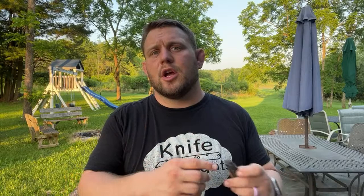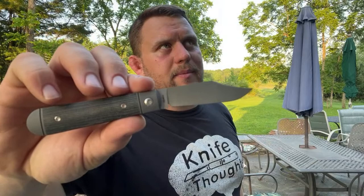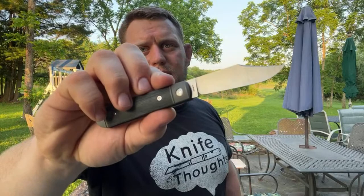I don't know exactly what the current plan is. He told me several different ideas. You can definitely get rid of blade wrap by sharpening — it's just a question of how much edge you have to take off. I measured mine before and after sharpening and took off about half a millimeter. It didn't change the profile a whole lot — it still has that super cool swoopy clip point — but it does change the shape a little. Other possible fixes include redoing certain parts of the knife to make it match the design. I'm confident that Ben will make sure it's fixed.